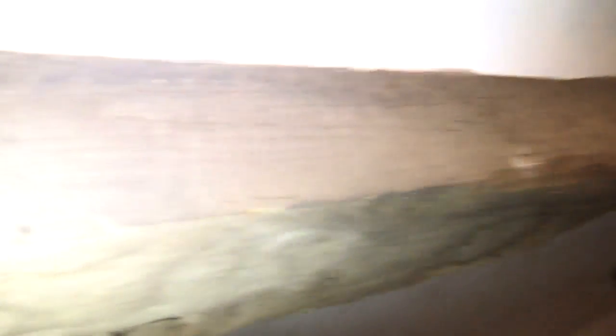The heartwood — that bit there — no beetle, perfectly okay. We've got this elm beam which is beautiful. There's another piece of elm across here, so a big purlin, both elm, and then the rafters are oak. Again you can see this very coarse graining compared to the beam you just looked at, and again on the outside that's the sapwood and you can see you've got beetle just in the lighter coloured sapwood. There's no beetle in the heartwood in the middle — it's only in the sapwood.